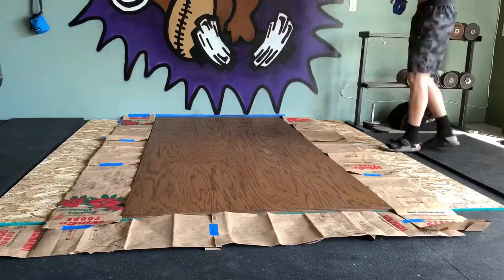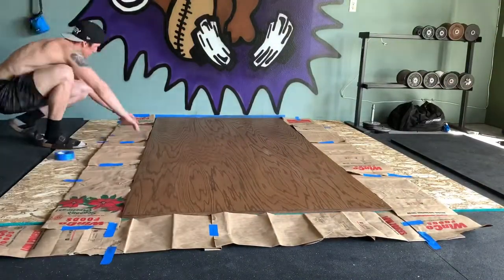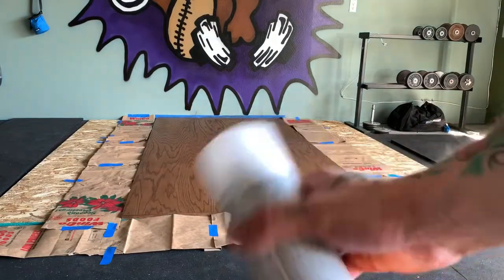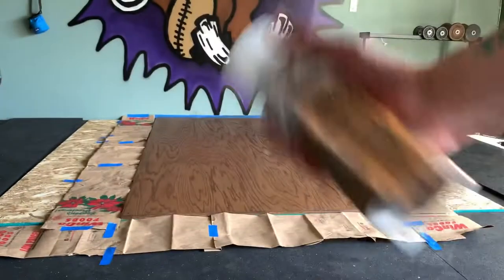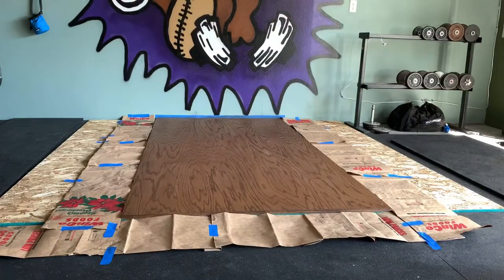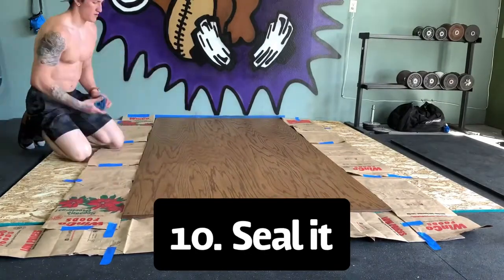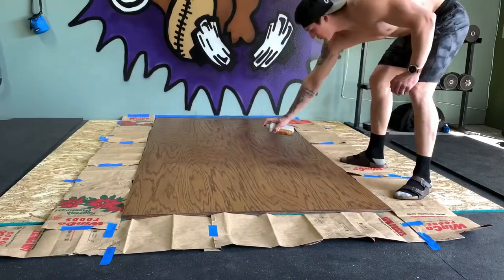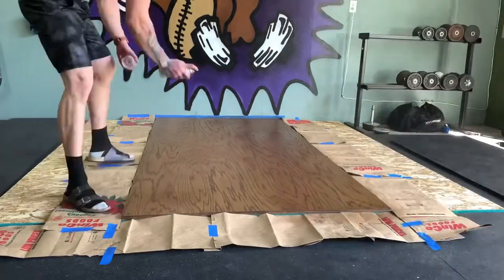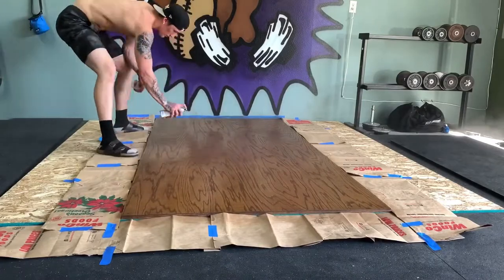I laid down a barrier just because I'm a little OCD and I like things to stay nice. After this, you're going to go ahead and spray your polyurethane coat — you're going to put your varnish on. Make sure it's clean again and just try to keep all the dust off of it. Spray it down even. If you've got a spray version, they also have wipe-on versions — I just personally like the spray-on version best.